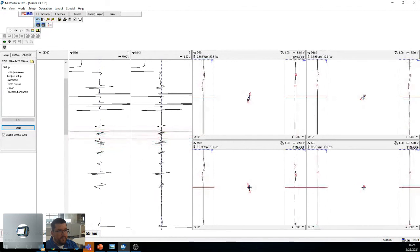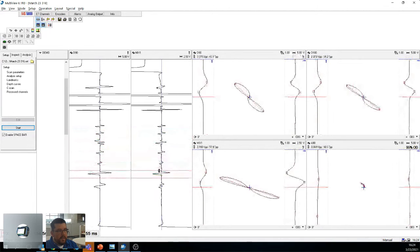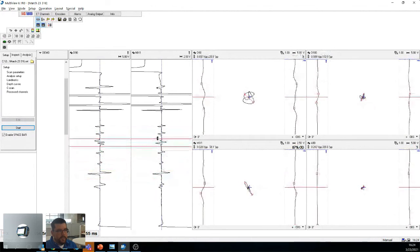It's impressive how the mix channel really helps eddy current become a really easy technique to use. Because imagine this: you have an exchanger, you're scanning, you're going to have a whole bunch of supports, and they're going to be almost constant on the screen. So a lot of the time you'll have almost nothing to say. And then when you start having weird support signals like we have here, you'll say, this is weird, I'm going to investigate. And then you start investigating on mix.